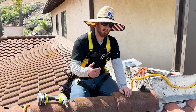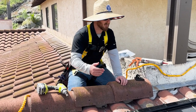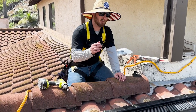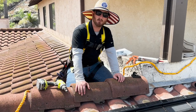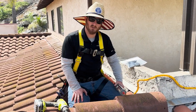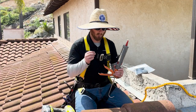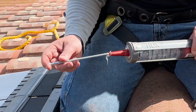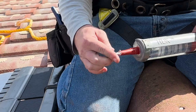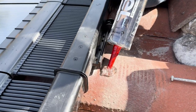If you have space on your roof to drop the panel down a little so you don't have to use the top tile, then you're completely okay using the quarter-inch by inch-and-a-half screw and anchor. It's very important to use a high-quality waterproof sealant. The one I always recommend is called Lexel. No matter how warm or cold it is outside, it's always going to have a little flexibility so that your hole is permanently sealed on your roof. Lexel is available on our website.